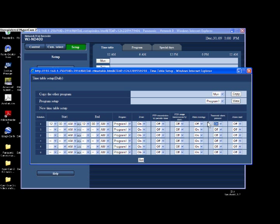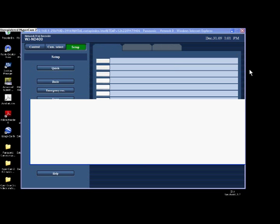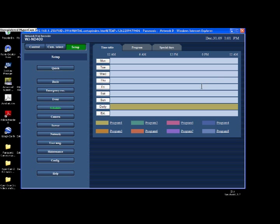I want to make sure that my Panasonic alarm protocol is turned on because I do want to accept the alarms coming in from this camera. I'll turn the alarm message off, because if you leave that on you're going to get an alarm message pop up on screen from every camera that sees motion, which can get quite annoying if you have multiple cameras. You can turn that on and off by time and date as well. Hit Set — now we're accepting the Panasonic alarm protocol.